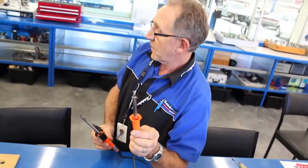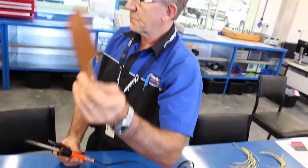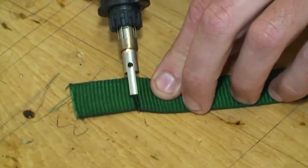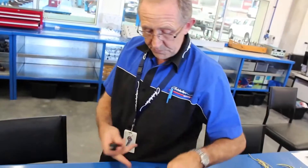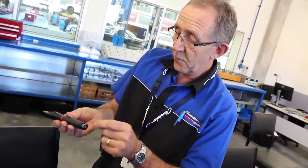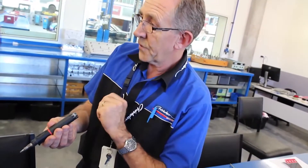This one here is regulated at around about 15 watts, which is good for doing circuit boards and that sort of thing. But if you want more heat, you have to go up to a larger soldering iron around 25 to 30 watts, and that's for terminal soldering. That one would be too light. This here is capable of up to around 25 to 30 watts, and you regulate it by the amount of heat you put through it — turn it down for lower power or up for higher power.